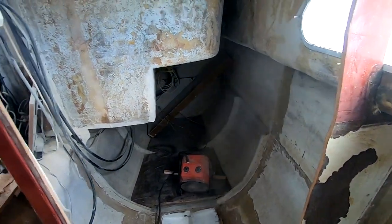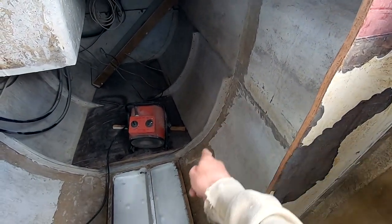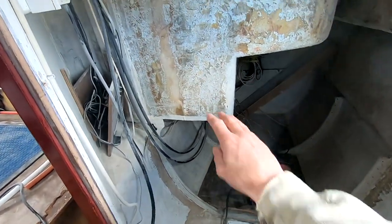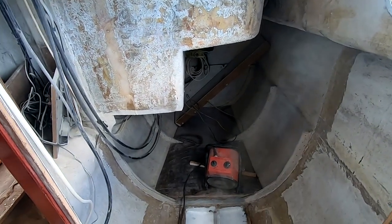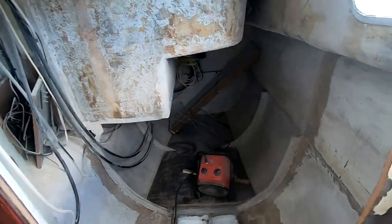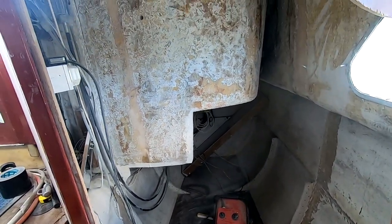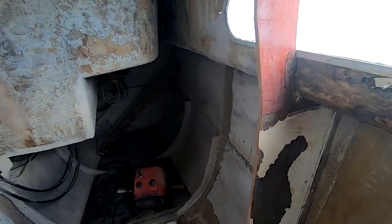And then what I'm thinking is, I was just going to screw onto the pieces here, but I think I'm going to have epoxy on that edge there, a nice thickened epoxy, and on here, squidge it on. I'll make up some timber struts just to push it tight against there, and I'll put a couple of self tappers into them, just to hold it nice and tight while the epoxy's going off. Yeah, I'll stop talking and I'll get on with that.